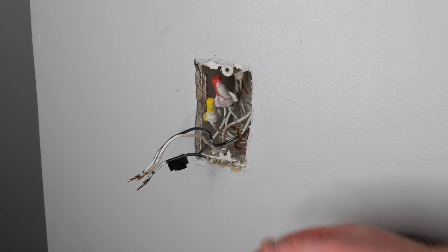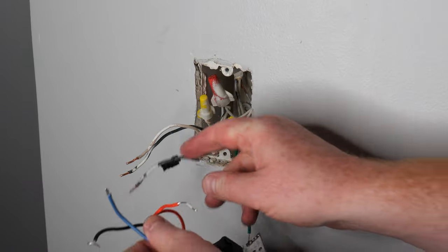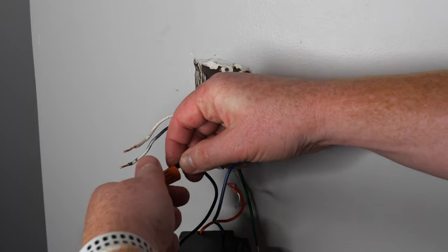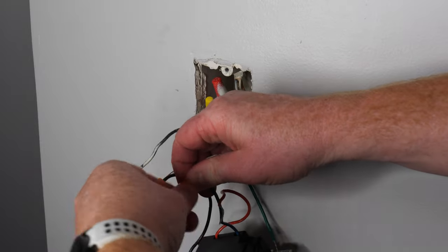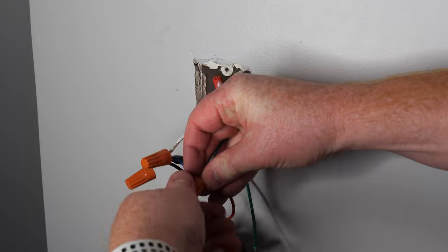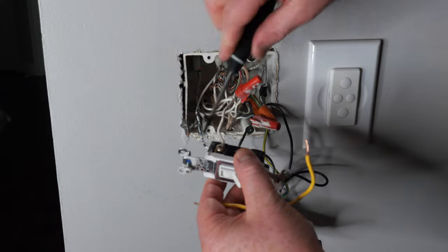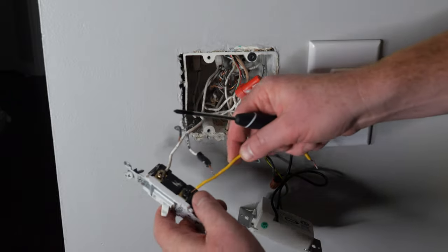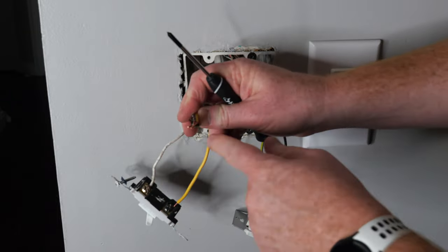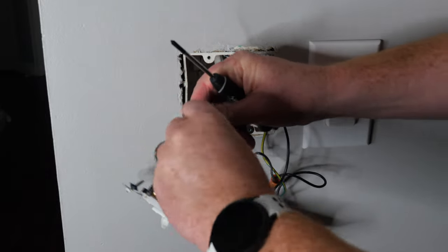Let's try the Diva on the other end with a mechanical switch on this side. Here at location one we're going to remove the switch, attach the ground, then attach the line to the black. We're going to attach the white to the blue or miscolored wire, and attach the black traveler to the red. Then we take our white traveler and put it on the brass, our jumper on the common, and tie our jumper, our load, and our black jumper together. That's it for location two.